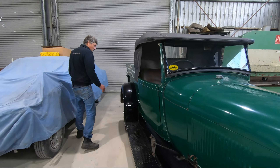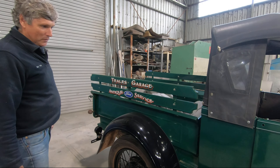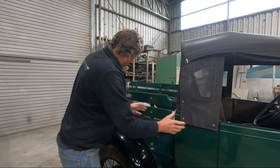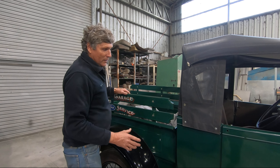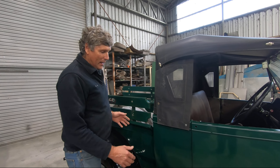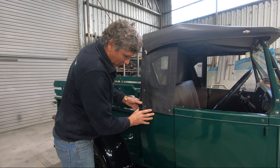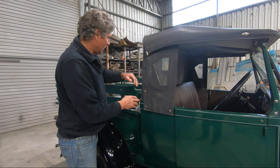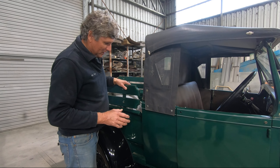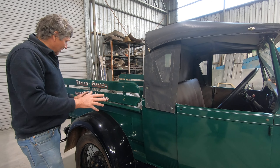If you come down the back, it's actually a replica pickup. Here in Australia we never had the pickup, and this one had been a touring car that had been made into a ute — they'd taken the back doors off, thrown the tub away, put a wooden tray on the back. We looked at a picture of a pickup and figured that if we used two of the door pillars and welded them together, we'd almost have a seat back. We added some sheet metal for the back of the cab with a bead line rolled across it. The dimensions aren't great but it proportions well when you stand back and look at the car.